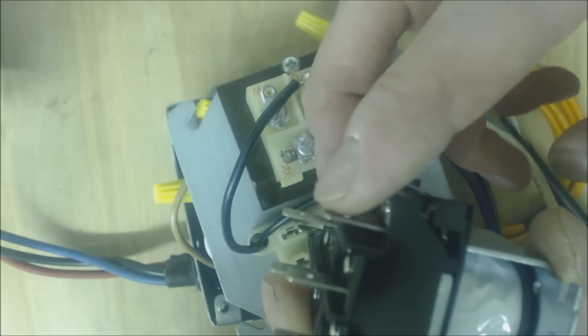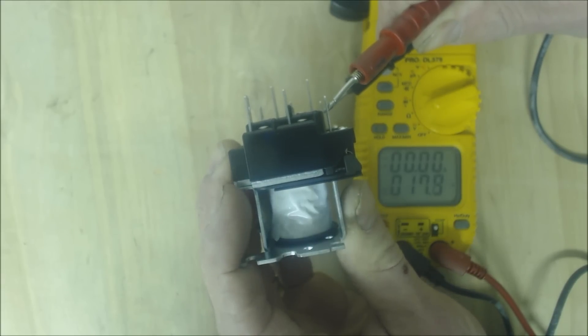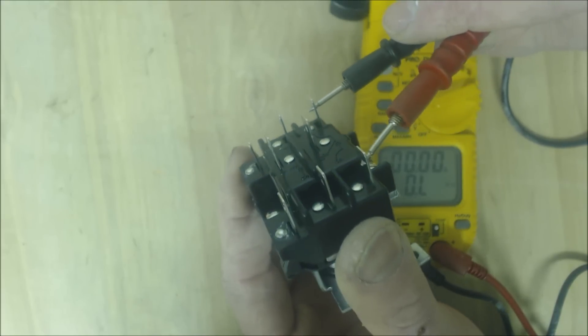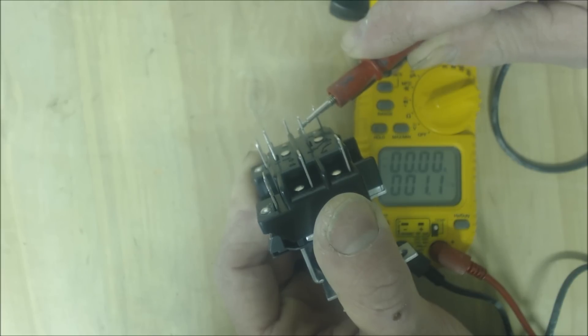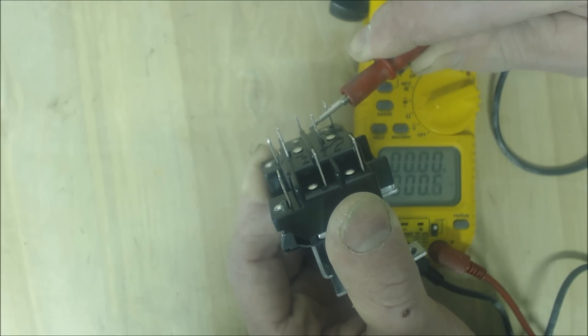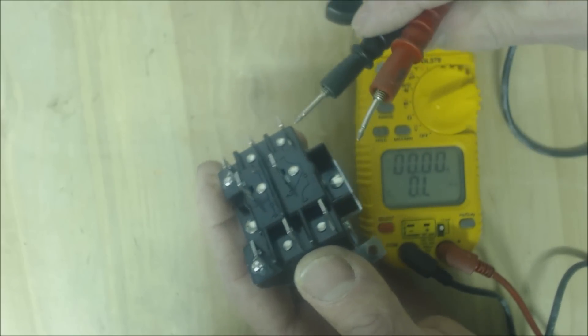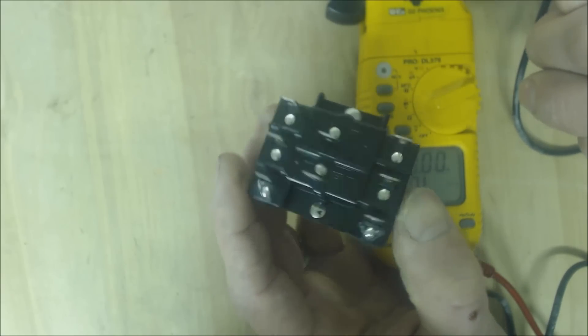If on the coil side of the general purpose relay you test it and get OL for resistance reading, it's no good. You can see we're testing the lower side — the coil part of the general purpose relay — and we are getting 17.8 ohms of resistance. Then terminals 1 and 3 on the back side should not be connected when unpowered, which means OL; and terminals 1 and 2 should be connected, meaning you should have right around zero ohms of resistance. We do have a little bit of resistance but that just has to do with pressing the probes into the wires. Upon testing with resistance everything looks good, so you might want to go ahead and power it with 24 volts here and see these contacts go ahead and close. If it does close, you know you're good in reference to this item.